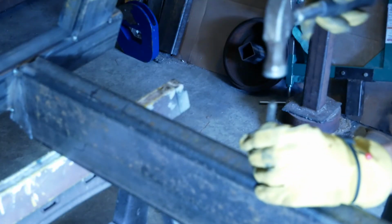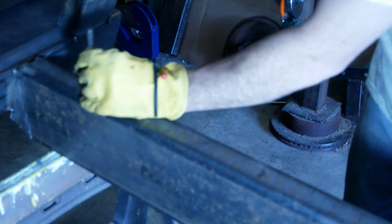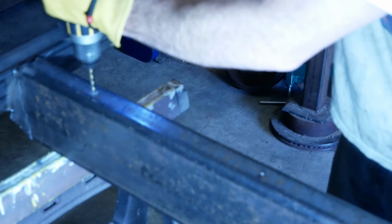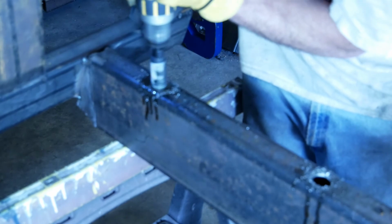This comes out of the top of the shrinker stretcher. Welded a couple of washers onto some square stock and then cut those off to use as the connecting things. Punched a couple of holes in the narrow end of the upright, and this is going to create the groove where the connecting rod will pass through.